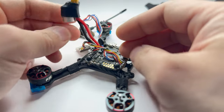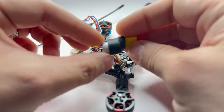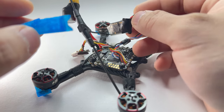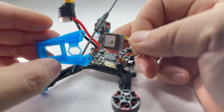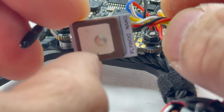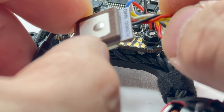You can see what I did with the XT30 — this is the length, so it's poking out the back of the quad. Here's my cap and I just shrink-wrapped it. Next up we're going to put the Nano RX and also the Nano GPS into its holder. At the moment this is the only GPS that fits the holder. The STL files are online — if you're using a different GPS you could totally go ahead and modify the file.